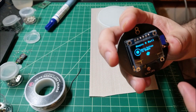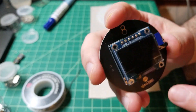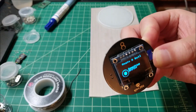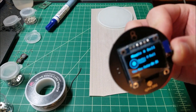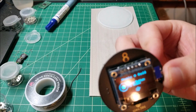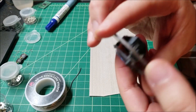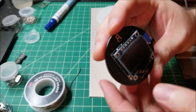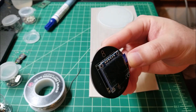If you're interested in how it randomizes: I'm using the rand() function, which is pseudo-random. What I'm doing is depending on how long you press and hold the button — while it's running the animation it's counting up really fast — and it stores that value after you release, in order to seed the rand() function. It's more random because a human can't hold the button for an exact amount of time every single time. I'm also waiting on little surface-mount speakers to arrive, which would just beep a one-kilohertz tone every time you press the button — a cute little thing, though not necessary.